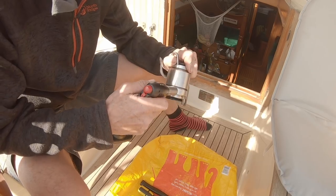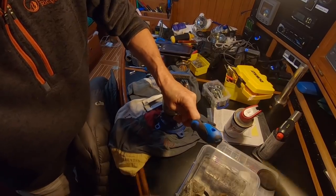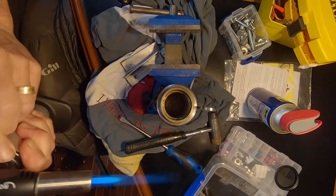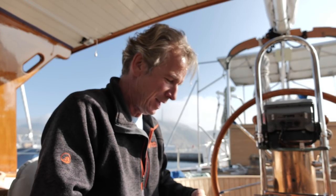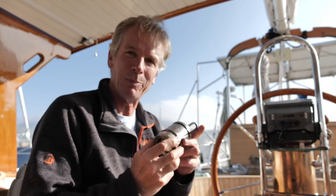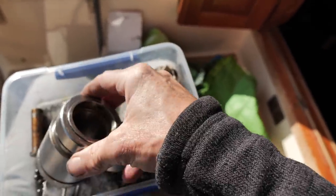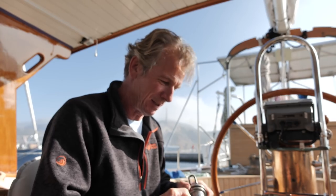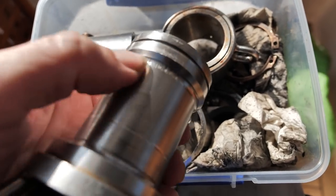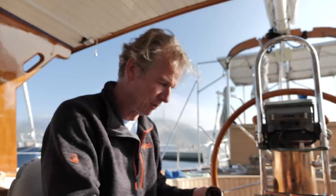I said I'd just take the circlip off and have a look, but it's not coming apart. It really has been two days trying to get this thing apart — using heat, banging it, Plus Gas, leaving it overnight, and then trying again. Must have been about five times heating it up and bashing it. Finally it did come apart. We've got a million different bearings now to go back in, and you can see it's a bit marked inside — it needs polishing out, maybe with a Dremel or something.